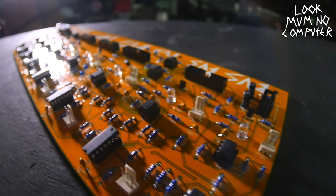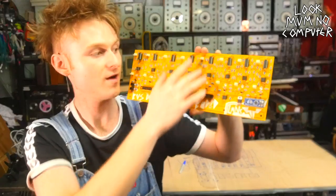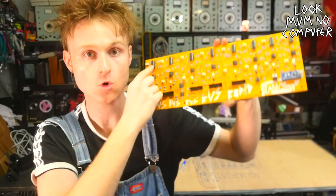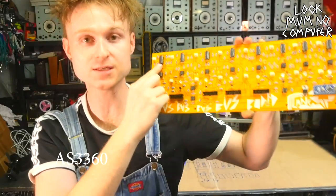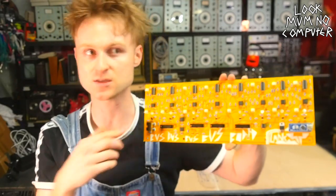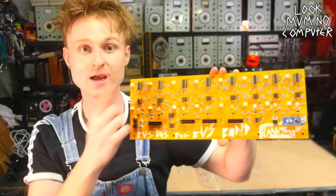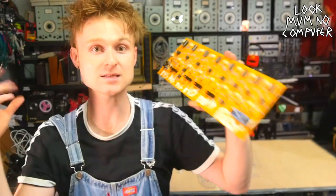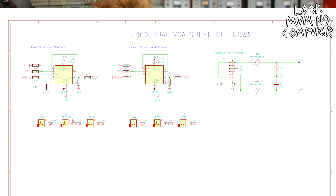Basically, you can see there are 8 rows of chipsets. The top chip is actually 2 VCAs all in one chip. It's called the AS3360, and these are found in a lot of 1980s polyphonic synthesizers, so I figured, why not use these? You can get these off the internet. There's a link in the description if you want to use these, and there's also a schematic of how you can use them on their own.